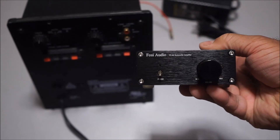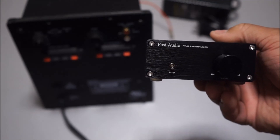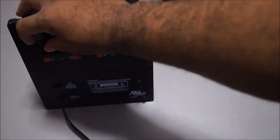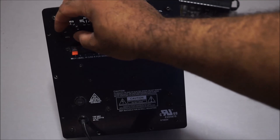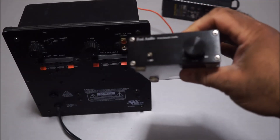If this amplifier is full-range or the frequency response is too high, you can block it with a crossover you build yourself — limiting the response to only up to 100 Hz, for example, so it goes from 100 Hz down to 20 Hz. This is what this amplifier is designed for, since it does not have an adjustable frequency response built in like the full-size plate amp does. The plate amp's built-in crossover acts as the filter for your subwoofer driver — that's what you really need when using it with a subwoofer.